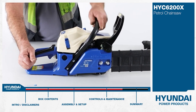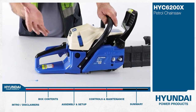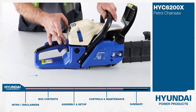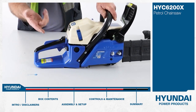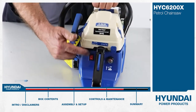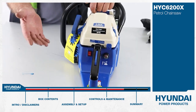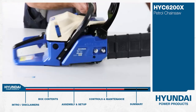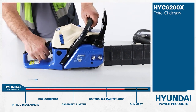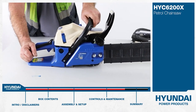So on that note, with a warm engine, so we just stopped the machine, we went and did something else for maybe a minute or so, we may not need to use the choke. So basically we can just, as we stated earlier, with the chain brake on, switch it on, pull the recoil, engine starts, it's pretty much ready for use again. If we were ready to take our cut, we turn the chain brake off, do our cut, always at the end of a cut, put the chain brake on.